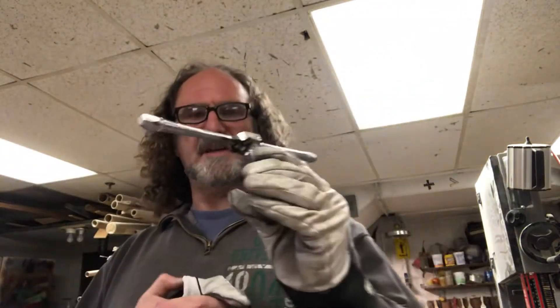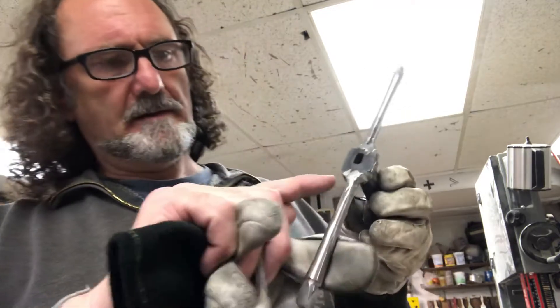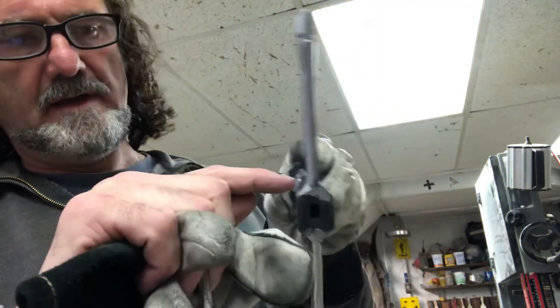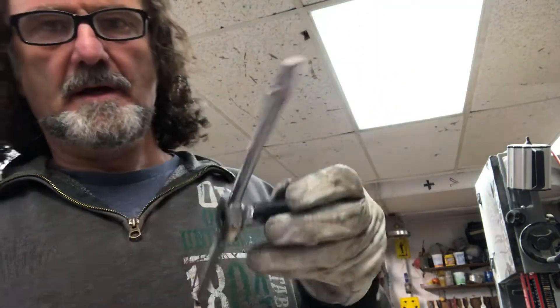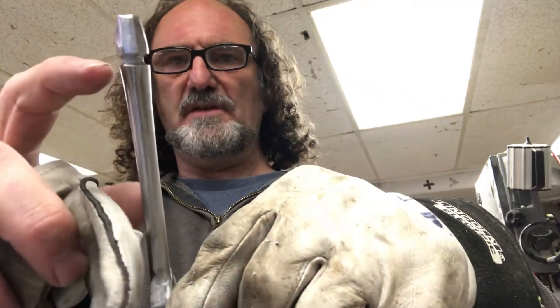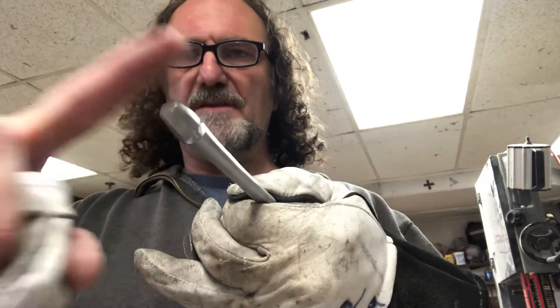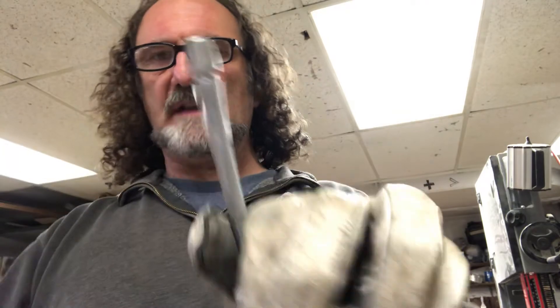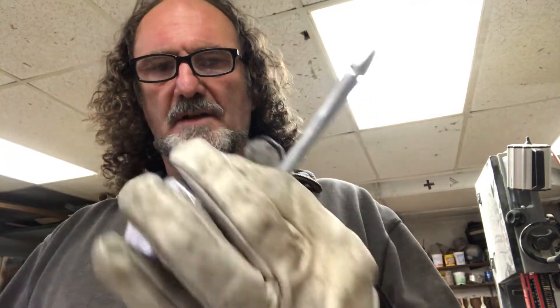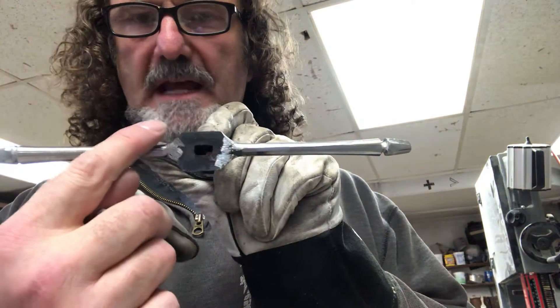I've been doing some work on this thing. You can see the square there - I've actually welded in this little point all the way around, and welded in all the way around here. I've also shaped it, kind of fine-shaped this stuff. I've actually used a little hand file, and used the sander grinder to basically take down and start to create these flats on the ends.